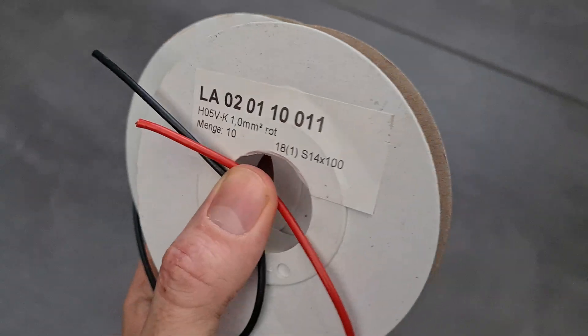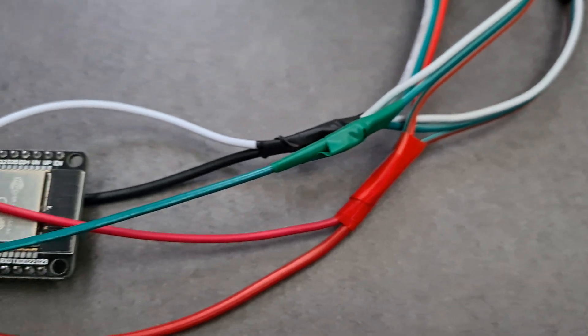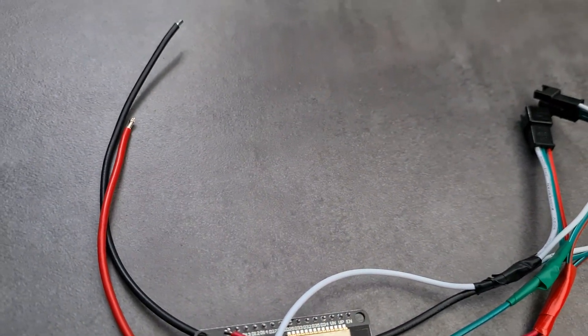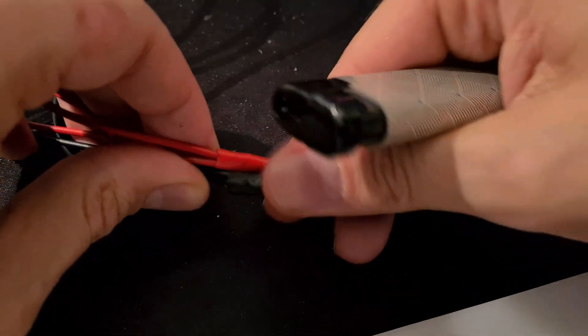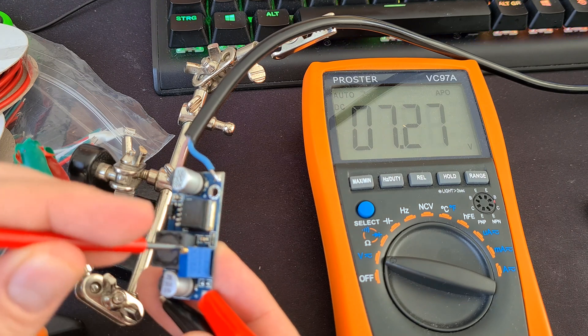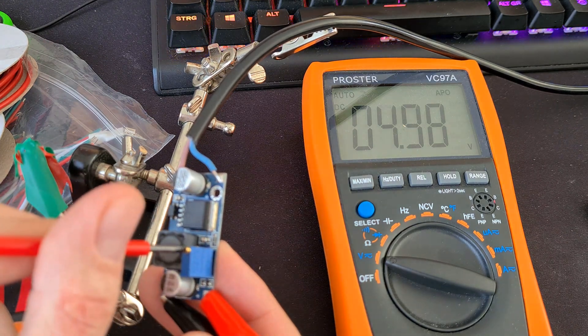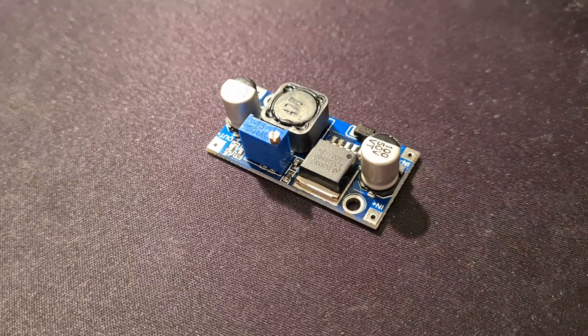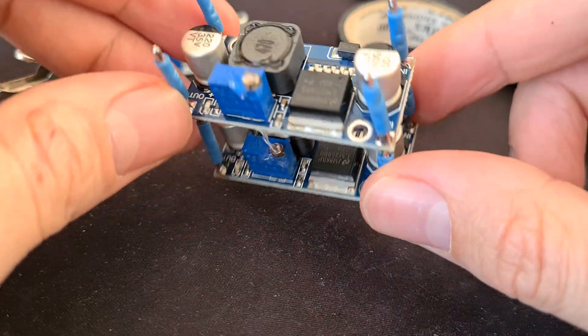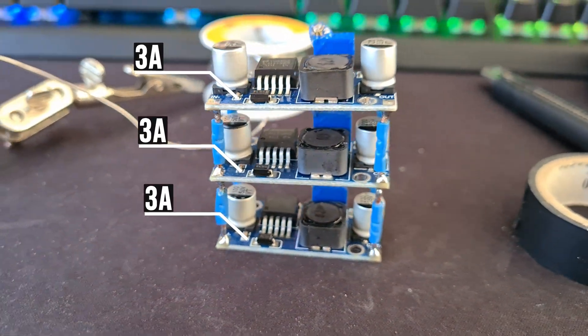I really liked how the top turned out. For the electronics, I used 1mm² cable, which will be enough to handle the 10A current peak of the 180 LEDs in total. I soldered the female LED connectors to the ESP and bridged the power lines to get one giant busbar. Because the input voltage will be 12V, I gathered three adjustable voltage regulators and turned the voltage exactly to 5.12V on each of them. Pro tip: you can skip that step by just using a 12V-based WS2815 LED. Then I stacked them to get a 9A 5V power supply, since each buck converter delivers up to 3A. This does not quite meet the required 10A peak of all the LEDs, but I will address this later.